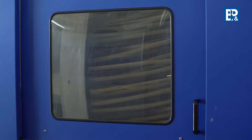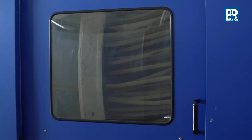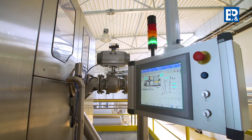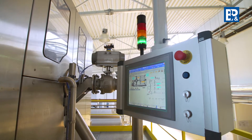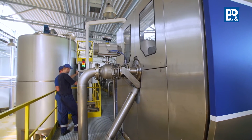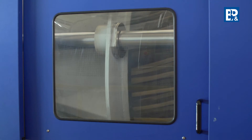After completing the press-filling-up cycle, pressing takes place. The piston presses the pulp and the juice flows out through the filtering elements into both the juice chambers encased in the resistant board and the press-down board. Then the piston retracts while the cylinder is rotating, and the entire pulp is carefully loosened.